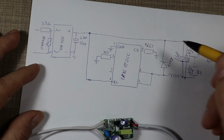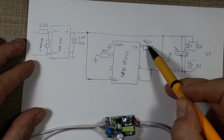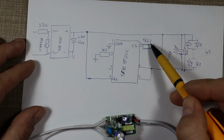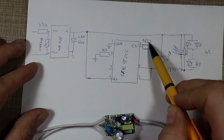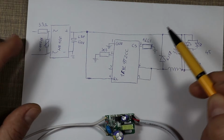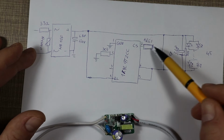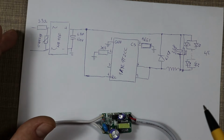And that's basically it. I'm gonna actually try to increase the resistance of this resistor here. I don't have any surface mount resistors, but I'm gonna try to find a through hole resistor to increase it to 3 ohms. So this is 1.65. Increasing it to 3 ohms should theoretically reduce the output current to half of what it is. Let's see if that works.